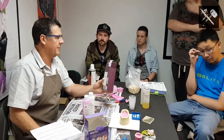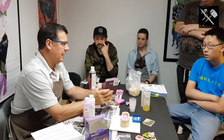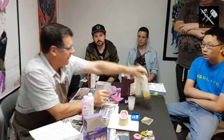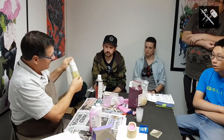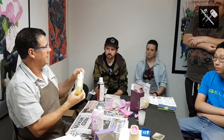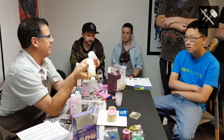I've told you all the good parts of polyurethane. The bad part about polyurethane, apart from the shelf life, is moisture in the air gets into the resin, and the one that I've been using up until now just went in the bin because it's been sitting around a while. What happens, particularly in part A, and you'll see it, this build-up of orange in the bottom, and it's the moisture in the air, gets into the resin, reacts with it, and then it basically kills off the resin. Okay? So keep that in mind. You only want to buy what you're going to use in 3 months.